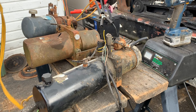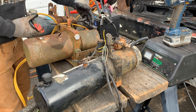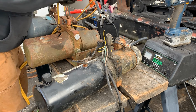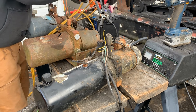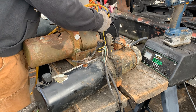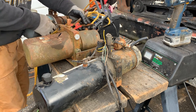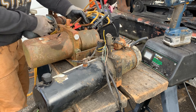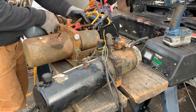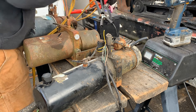We can try that control unit one more time. You want to ground this — the entire assembly is bolted together so it's grounded to itself. This is where your input current goes, on this stud here. Flipping this back and forth we can make those contacts, and I can see that everything in there is corroded, so that's no good.